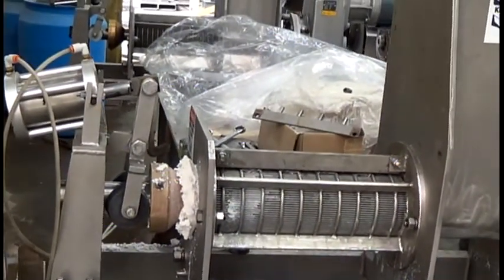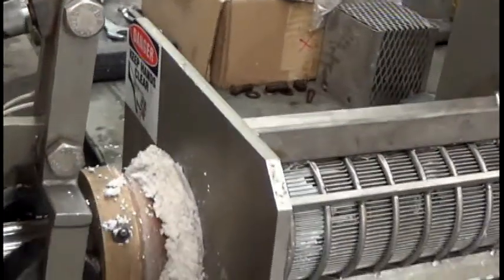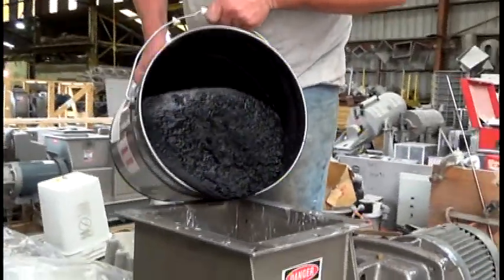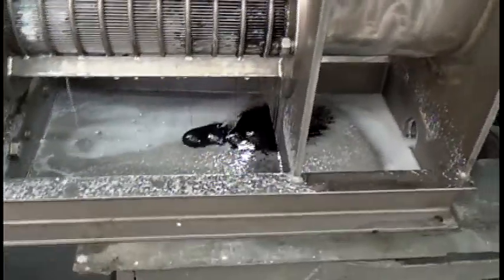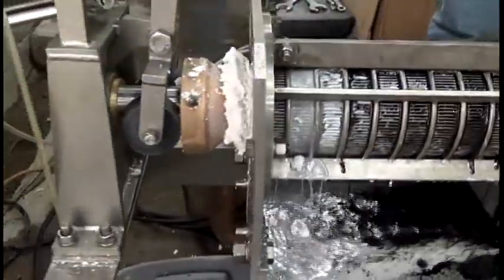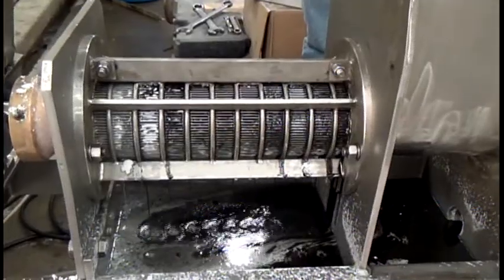You can go ahead and turn it on, Bill. Going backwards — okay, now we're going forward. And here comes the crumb rubber. Getting out liquid. This stream is 15 to 20 thousandths opening — same as for the one we ran last week.